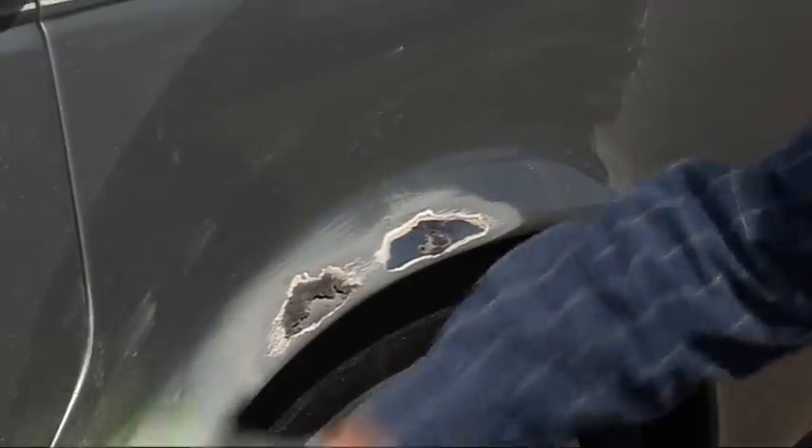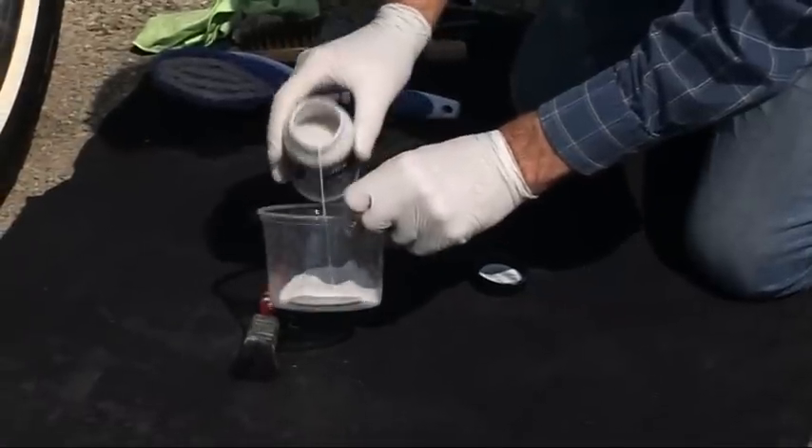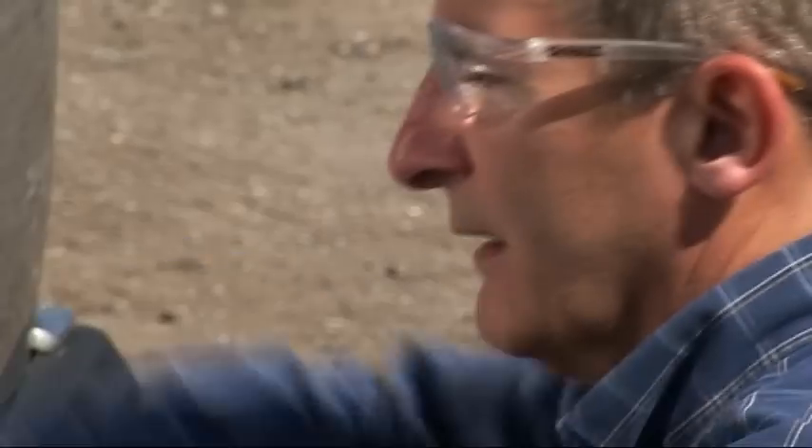It's recommended that gloves and eye goggles are used for your protection. Shake the bottle well and pour the required amount into a plastic container. Brush a thin even coat directly onto rusty areas, ensuring that the liquid is worked into any pitted sections, corners or edges to avoid future rust creep.